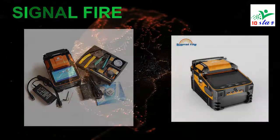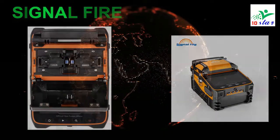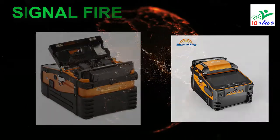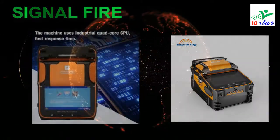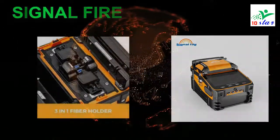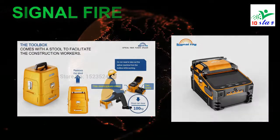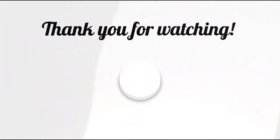The 5.1-inch screen with resolution of 800x480 pixels and adjustable brightness makes operation simple and intuitive, even in difficult lighting conditions. The optical system offers a magnification factor of 300, making it very easy to observe splicing operations and visually analyze results. The minimum splicing time is 5 seconds and sleeve heating time is only 15 seconds. The included USB adapter allows charging a smartphone or connecting a USB lamp when working in the dark. The device is equipped with a 7800mAh rechargeable battery, providing enough energy to perform 240 splices with sleeve heating cycles, with a battery charging time of only 3.5 hours.